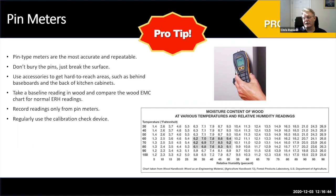This is a good chart to just print out. In your mind you can think: this building should be at 12–14%. If the whole building was at 11% and you saw something at 14–15%, you might think: is there a problem here, or has there been one in the past? Maybe there's some moisture ingress that's no longer present, or it's not raining and it's drying out — some form of deeper diagnosis might be warranted.